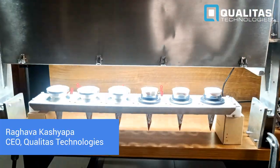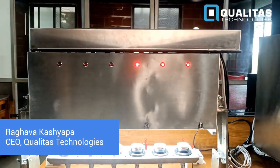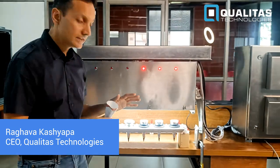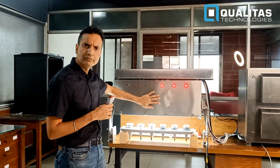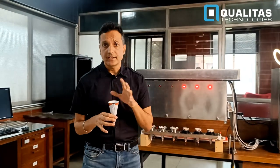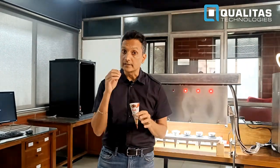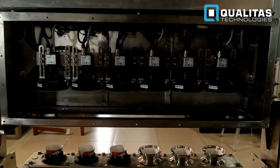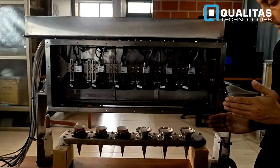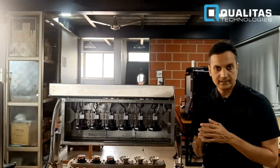Let's take a closer look. Each of these systems has a camera and a light flashing on it, and the LEDs here are identifying which ones are rejected and which are not. One of the things we do before we ship it out to our customer is do a load test — we simulate the actual manufacturing line with a heavy duty cycle. This system has been running for almost 24 hours now. The image is being captured and then it checks for three parameters: the presence of the sleeve, the presence of the cone, broken or cracked cone on any surface, and the presence of the chocolate. The strobing you see here is when the inspection cycle is ready to start, triggering the cameras to take an image and do the inspection.